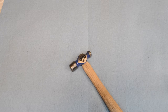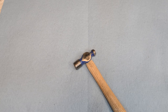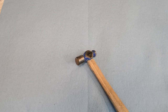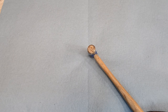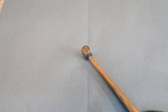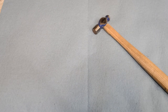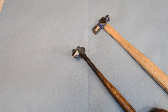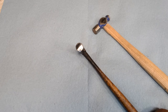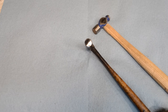Let's talk about tools. In this particular case, a portable, manually operated, optically guided inertial impact delivery device — you would call this a hammer. This particular hammer lives out in my car for a very specific task and does not require its face to be polished. If you hit a gun with a hammer that looks like that, you're going to transfer every last little mark onto the finish of your gun. Don't do that. Your gun hammers — this is that two-ounce ball peen you see me use every week — this thing gets its face tuned. That is what a gun hammer should look like: polished to a mirror. It's not hard to do.